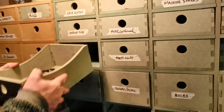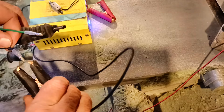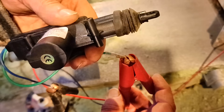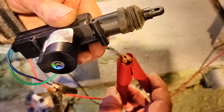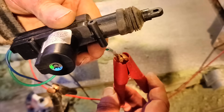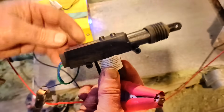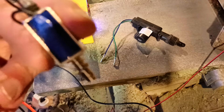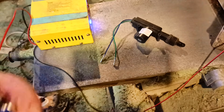I looked specifically at electromagnets or solenoid switches — they could work, and a car battery would provide the 12-volt supply they need. But when I tried out two different small electromagnets I soon found they don't like being left on for more than a second or two; these ones at least start warming up ominously. A second or two might be long enough for the character to pop up, but lots of experimentation would be needed — how long does it take someone to see and react to a popped-up target?